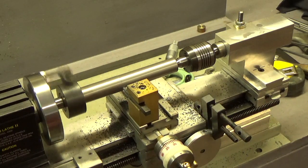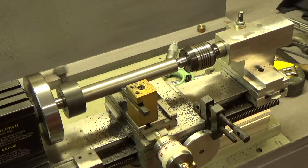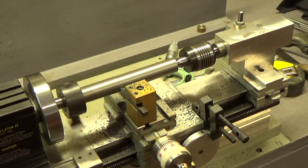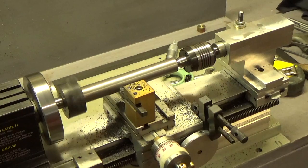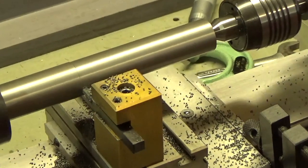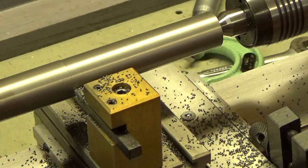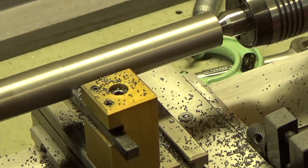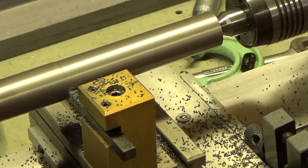That's kind of a heavy dog on the lathe, so I'm running the lathe a little bit slow, but it seems to be going along. Let me see here if I can zoom in on the tailstock and zoom in on the cut. Well, there's the cut, just going along. I'm not pushing it. The feed belt is in the middle position right now, and so it's feeding fairly slow. Actually, that'd probably be a nice finish on that piece of cast iron.